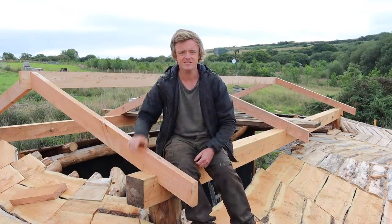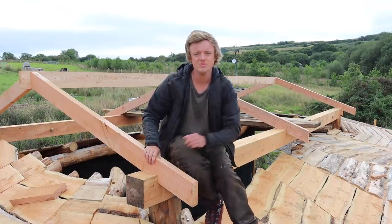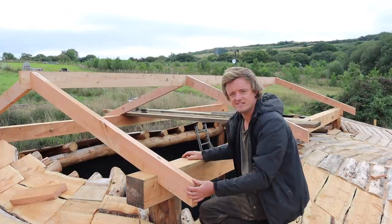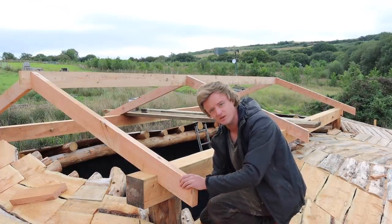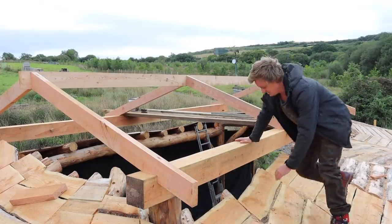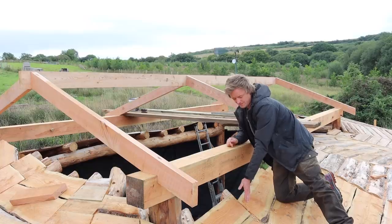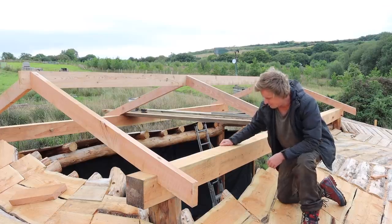But we have height considerations here. I don't want to lose the height. So the plan is to brace everything, this timber, from spreading outwards and from sagging in the middle off of other existing stuff that's hidden that we can build into the roof. So I have all these big timbers which are not going to go anywhere, underneath. So the plan is to have bracing from these timbers up to here, a slight slope, and then there'll be turf obviously butted up against that, which also adds a considerable amount of weight bearing capability.